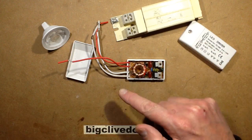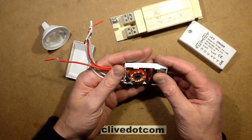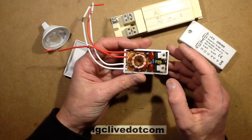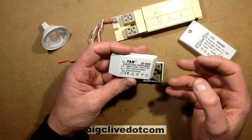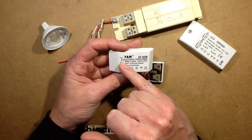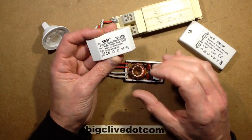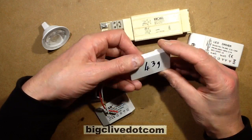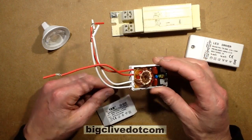It's quite good because these have very good power factor for an electronic switching supply because they actually ride the sine wave — they're chopping the output up but riding the sine wave as they do it, which means it is almost a unity power factor. However, the downside is that these electronic switching power supplies are for halogen lamps — the key word is it's an electronic transformer for halogen lights. And keep in mind, this one weighs 744 grams; this one weighs 43 grams — much, much lighter.